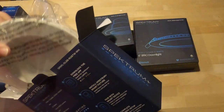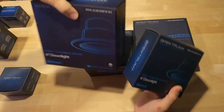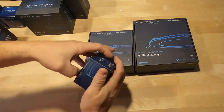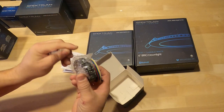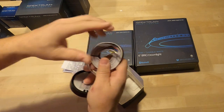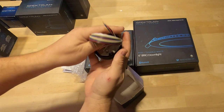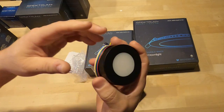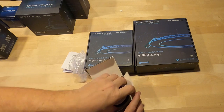I'm gonna save the unboxing on the 4-inch version — these are exactly the same as what I just opened, just in a 4-inch version, so no reason to open things twice. Then I'm jumping into the cabinet puck light — this is a new product for us, I have not seen these yet, so I'm excited. It looks like it's 24 volt. You can run this up into your cabinets, and if you have existing power, you'd put a small transformer and one of the RGBW controllers — now you've got a full color spectrum super high-end looking puck light inside a cabinet. These could also be put upward, maybe behind a couch for accent lighting — tons of applications.